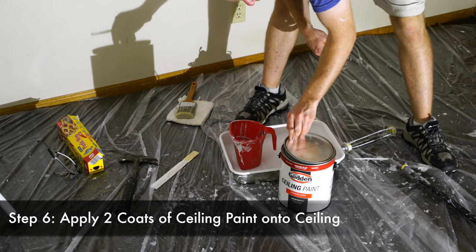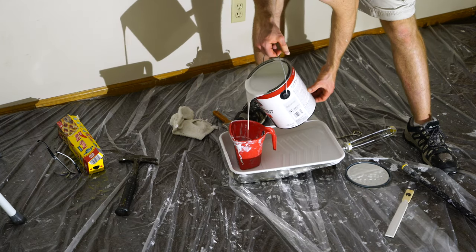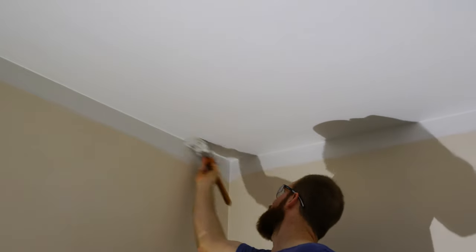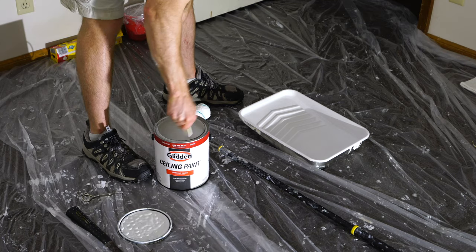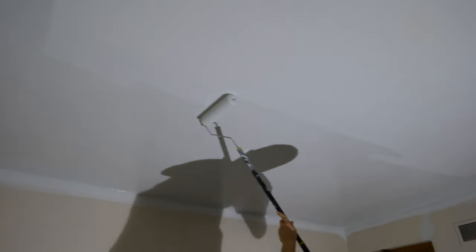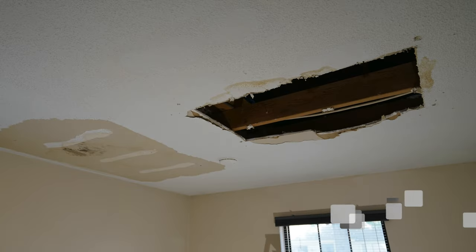I would definitely recommend painting two coats of primer before applying any ceiling paint. Apply the ceiling paint in the exact same manner as the primer, first cutting in around the edges. Note that when cutting around the edges I'm not worrying about getting white paint on the walls since I plan to paint them too — if you're not painting the walls, cut in exactly in the corner. I applied two coats of ceiling paint just like I used two coats of primer, and it came out looking great, hiding any remaining water stains. With our last step finally complete, the ceiling looks really fresh — going from a water-damaged popcorn ceiling with large holes to a perfectly clean white surface.